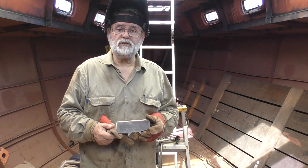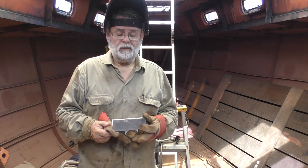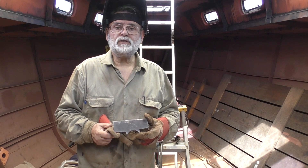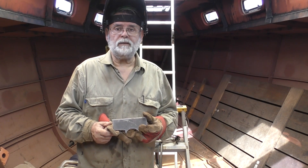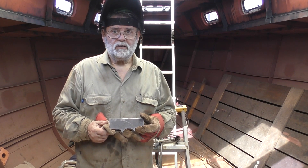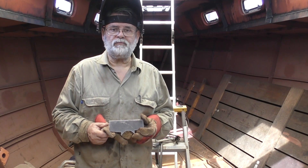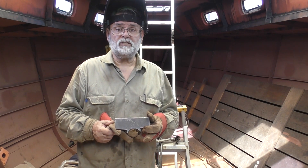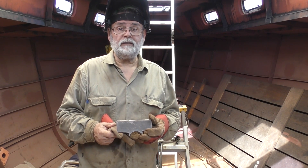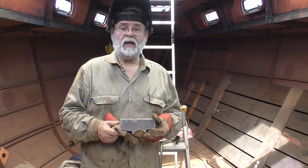The first thing I'll do today is make up this filler plate to fit inside the hull. That's going to sit around the top of the prop tube and follows the profile of where the bulkhead meets the centre line of the hull. I'm going to use this just for positioning — it will be completely welded in after. I'll tag weld it to the tube and then tag weld it to the bulkhead to keep the forward end of the tube in place and stop it moving.